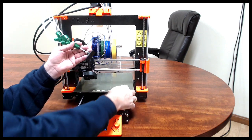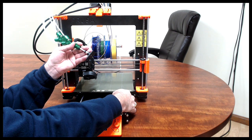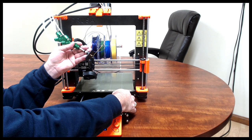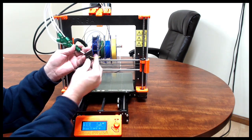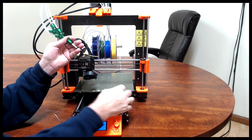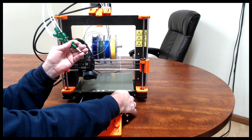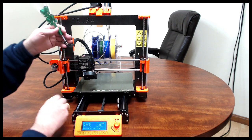Now let's go ahead and go back to the yellow and load it. We're going to do a one-second pulse to go back to the first color. And now we'll do a three and a half second pulse for loading — one, two, three, four, five — and then we can bolt this back to the machine.